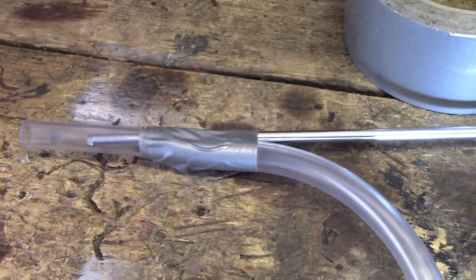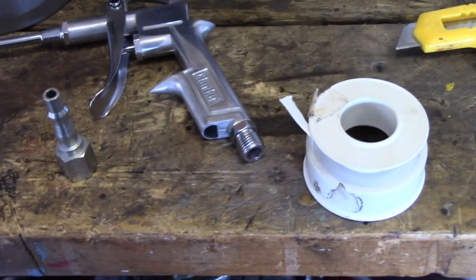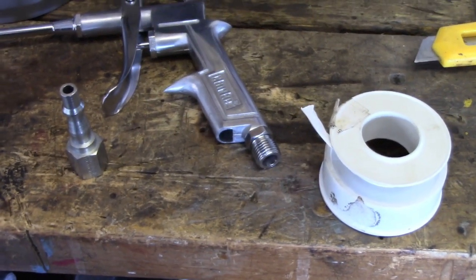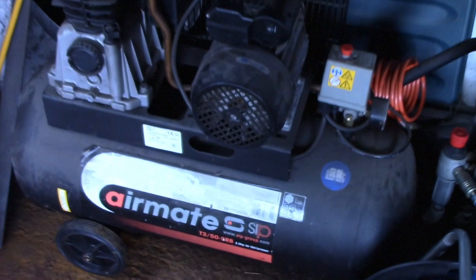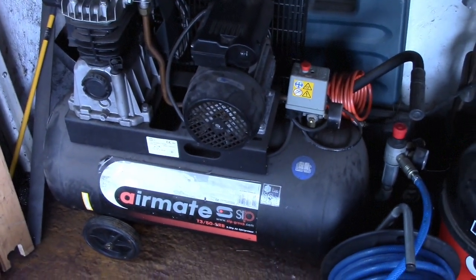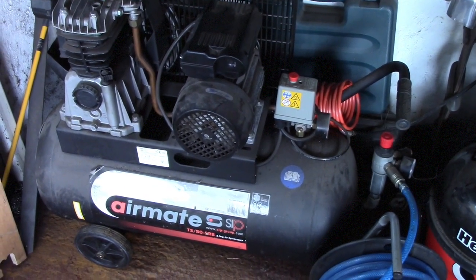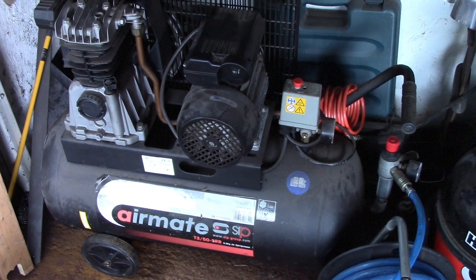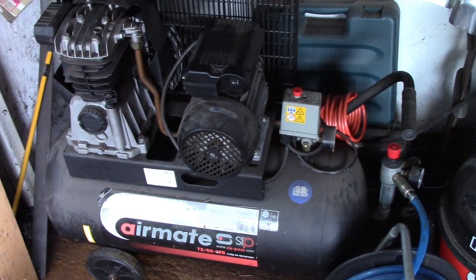Quick update: I've just gone and made a little hole at the end of the tube and shoved the nozzle through a little bit — sort of four or five centimetres maybe — and then tried to seal it up with some gaffer tape to see how well that works. And then to make sure I'm getting the full force of the air going through, I'm going to seal off the joint with some PTFE tape. The other thing you need in a homemade do-it-yourself blaster is a compressor — I've got a SIP AirMate T3 50SRB, which is three horsepower and 50 litre capacity. It hasn't got a great capacity but it's got a bit of oomph on it, that's not too bad.